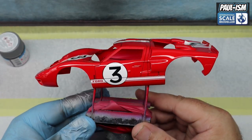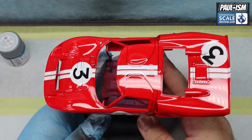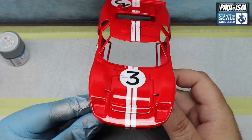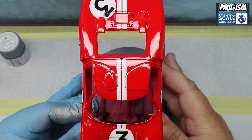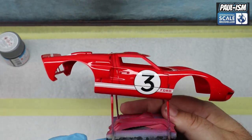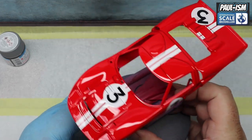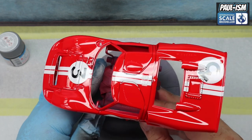A few days later — the car has been decalled and we've got our Pro Range 2K clear coat down. As you can see, no bleed-through on those decals whatsoever, so the LP9 barrier clear works very well. The Italian Red is stunning — very vibrant, an absolutely beautiful colour. The 2K has gone down over it flawlessly. Once we flat it and give it a good polish we'll lose that thick look of the 2K and be left with a very, very nice clear coat. Very happy with that.